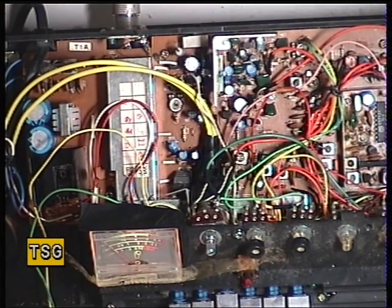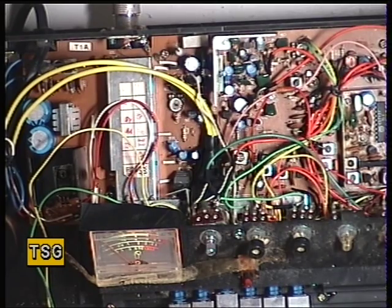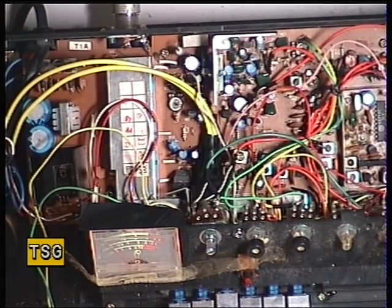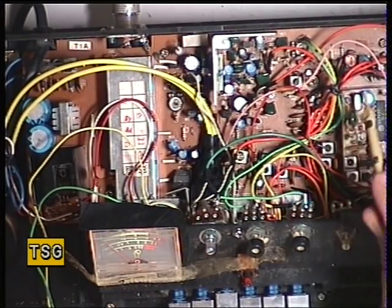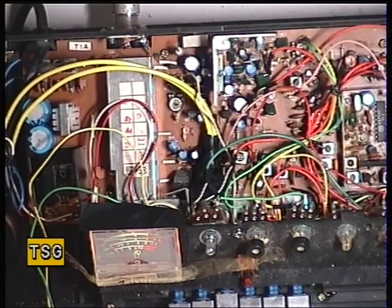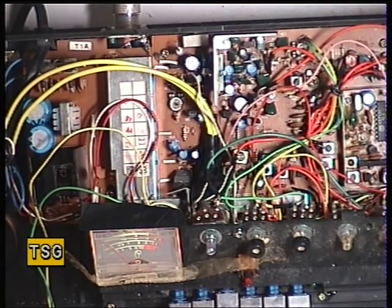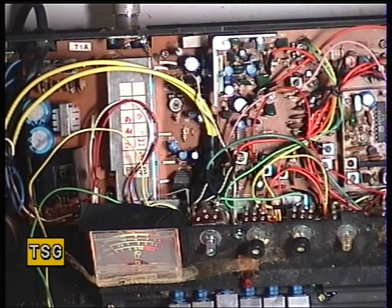When we do a demonstration on the aerial, you'll hear it hopefully working well. That concludes the setting up of the receiver — sorry it's been a bit patchy, I'm quite unfamiliar with these sets. You must avoid those four transformers unless you've got a sweep generator. If they've been adjusted, it'll have to be done by somebody with a sweep generator, or you'll be looking on eBay for one on the cheap — because if they're wrong, you end up with garbled receive.